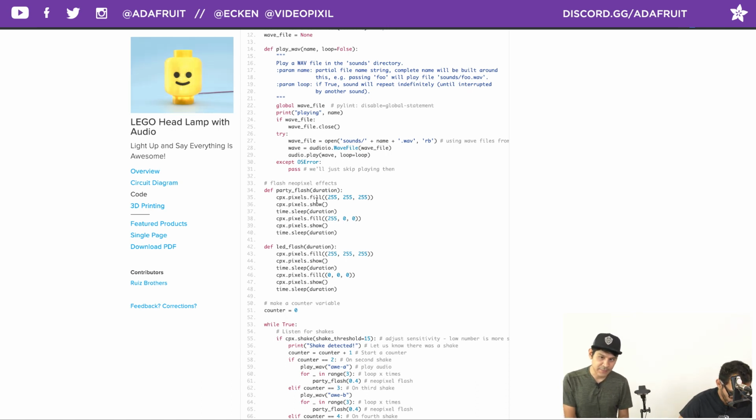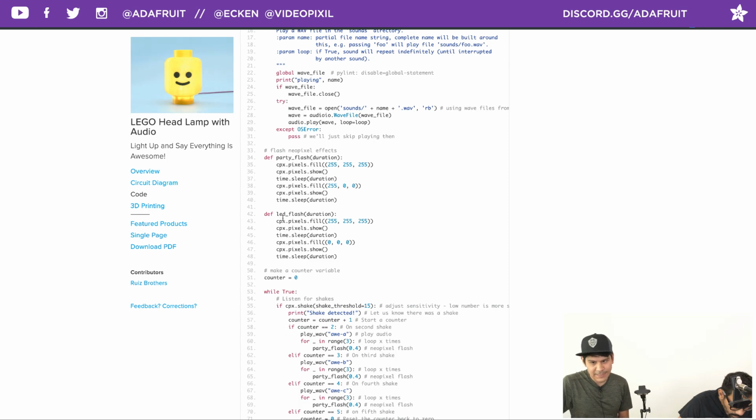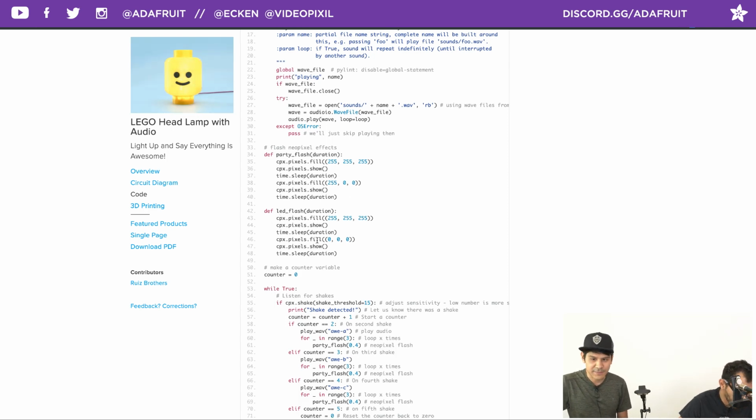Then I have a time.sleep, which says I want to show it for X amount of time. And then I have a different color. So basically what you're doing, you're saying, let's flash between these two colors with certain time in between them. So that's how I'm creating this party flash that you heard. So that's what that's doing. That's just flashing red and white. So you can see here the RGB values are there. Then down here we have another one called LED flash. It's pretty much a duplicate of party flash, except the colors are different.